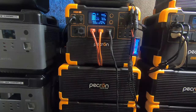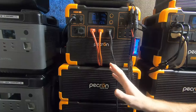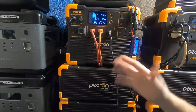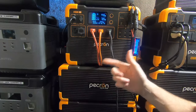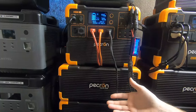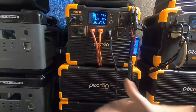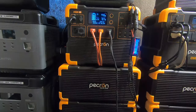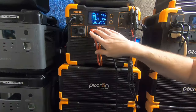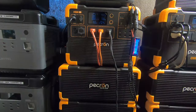Because I have to come into the shop every day anyway, why waste the extra energy on the Wi-Fi or the app if you don't need it? You can easily run this system without the app or Wi-Fi. I noticed that usually burns an extra 10 to 15 watts when that Wi-Fi card is on. Fifteen watts times 24 hours — that's almost 400 watt-hours a day just in Wi-Fi. If you don't need it, turn it off.